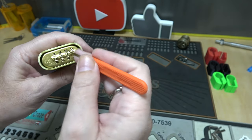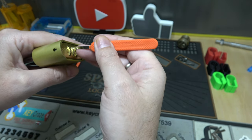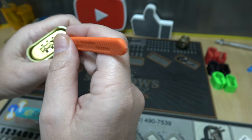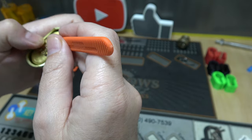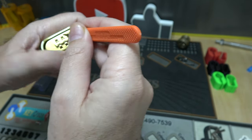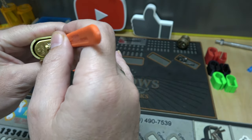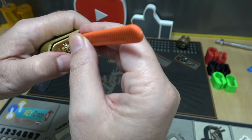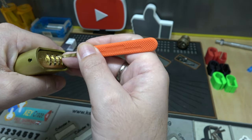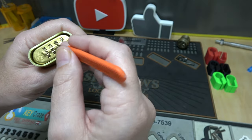If your knife does not fit in real easily, don't force it — these things are very thin and you don't want to destroy the tool. If it doesn't fit and go down in there straight, rotate the wheel to a different number, see if it fits. Still doesn't fit? Rotate another number. Keep doing this — rotate, still doesn't want to go in, rotate again. Bingo — that's the angle you want. Look how easy it fits! You just go down on the side of the wheel and bada boom bada bang. But if you don't have the wheel in that sweet spot, it just will not go in there. That's why you rotate the wheel until you find that sweet spot.